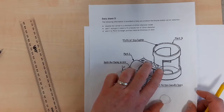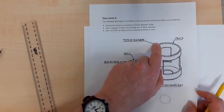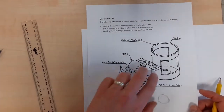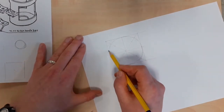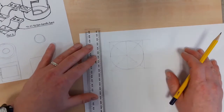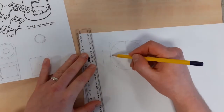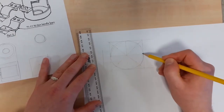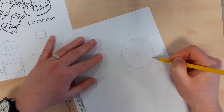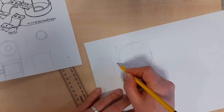That's us constructed the outside of the circle. We've got this little stick-out bit right here, and we're told it's 30 wide. We're told the inside is 67, plus three, plus three, is 73 millimeters across. 30 is just under half of that, so I think it's probably about that size. We've also got about a wall thickness to put in - let's follow that circle around, just trying to keep things proportionally correct, a nice thin wall section. And we've got two pegs there and there.